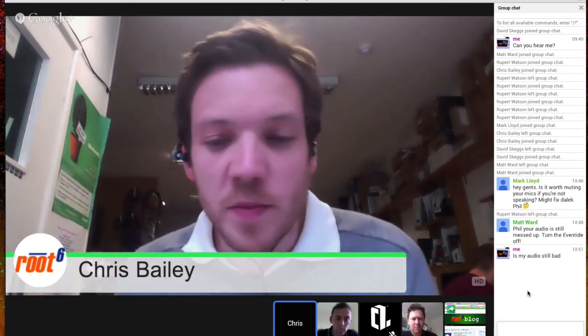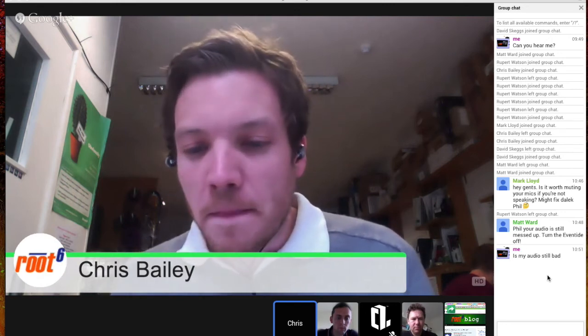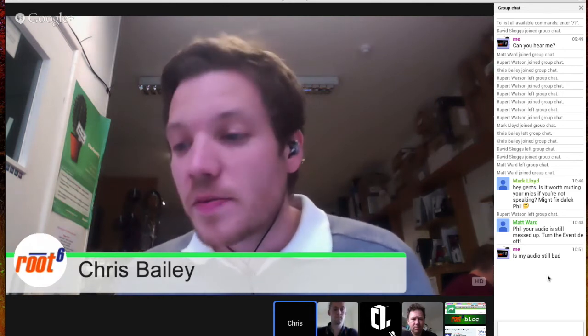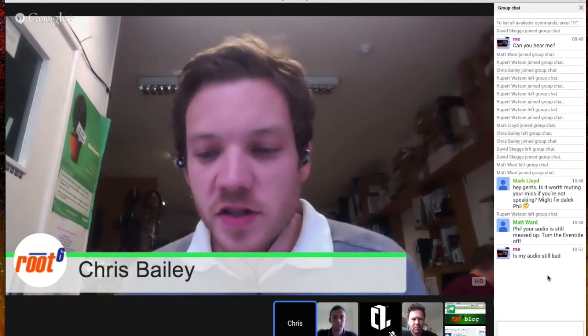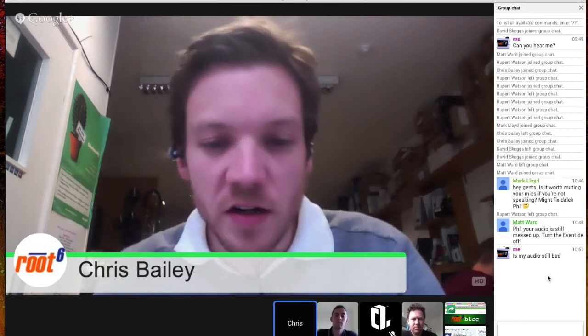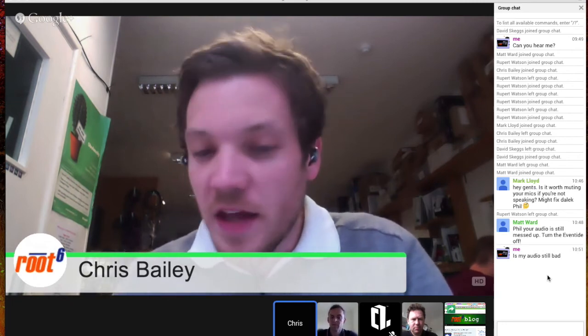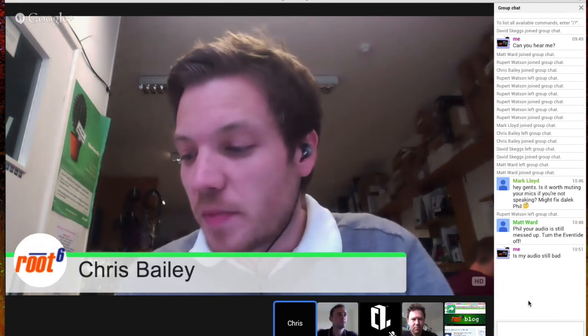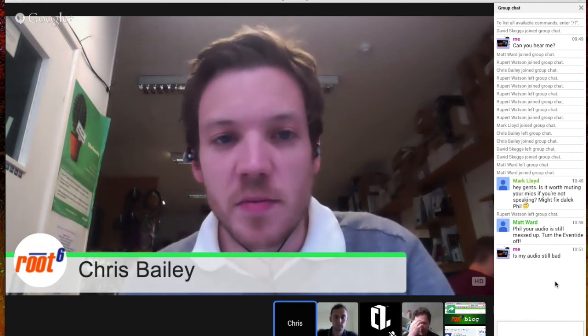So I'm just building the general purpose server, which will be the lookup server, the NTP server, and the DNS server. So that will live in addition to, obviously, the machine that the storage is sitting inside. Yeah absolutely. There's going to be three separate AS3000 servers. So one as a general purpose server running lookup service, DNS and NTP. There'll be a second one running as the Interplay engine, so the database engine, and the third one running as the dedicated media indexer for the Interplay system, and then the ISIS is very separate.